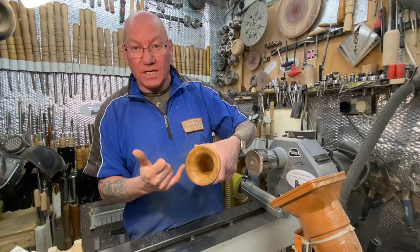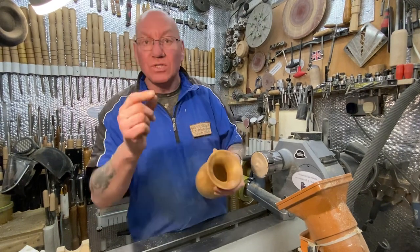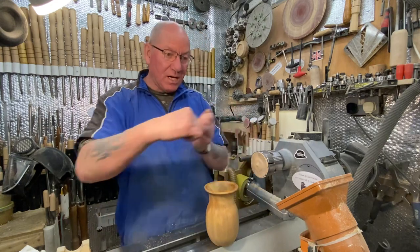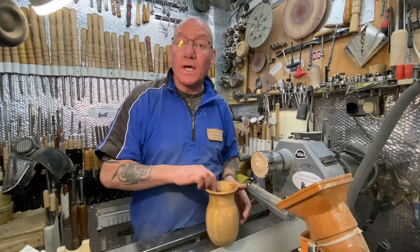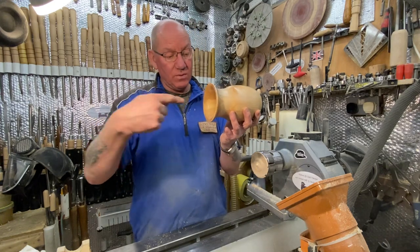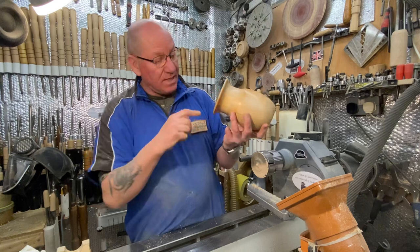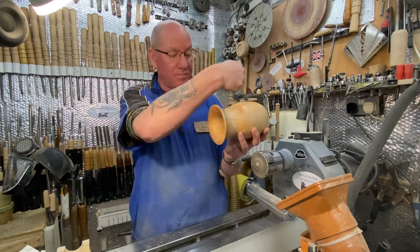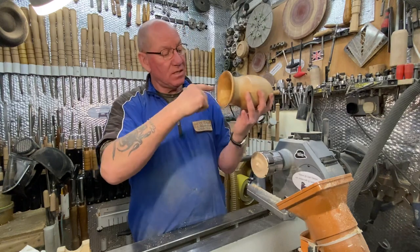I've done the outside of that, I'll come round it, okay? Because you can get it to cut, it shear cuts. A lot of people say, well, yeah, but you're coming the wrong way. Well, what's the wrong way? Because if you put that there, whether I go that way or whether I go that way, it's the same because the guts have gone. It only matters when you're going across that bottom because the grain's the same way on this.